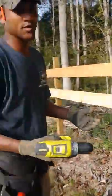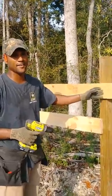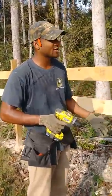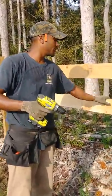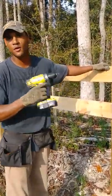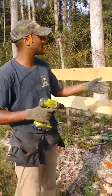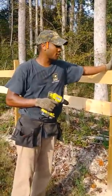One of the reasons I'm doing it this way is because I wanted to use screws rather than nails. I did some of it with a nail gun — makes it quicker — but screws are better for horses. If they kick through a board, you can easily unscrew it and pop a new board on, no problem. Those nails are a little hard to get out without ruining the integrity of your posts.